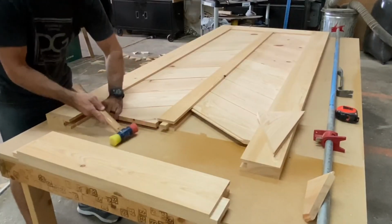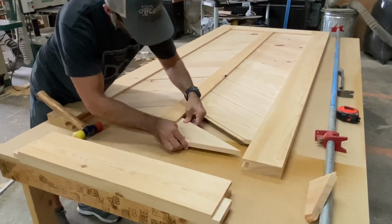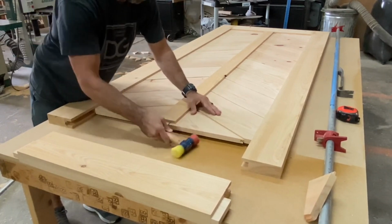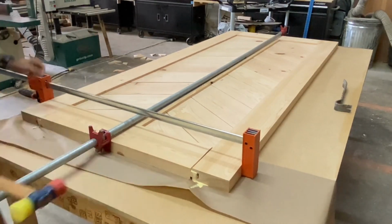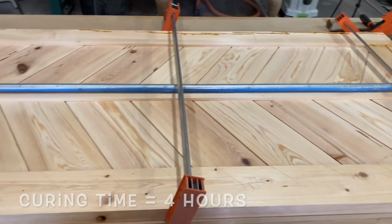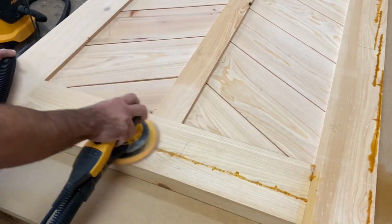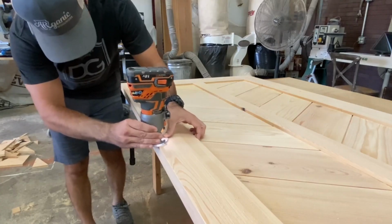Seasonal wood movement hates things holding it down like glue and nails and screws. And normally something like this, I would cut this chevron pattern out, I would glue it and nail it down to a piece of plywood and call it a day. But you end up getting warpage and you don't want that. I did get a few checks and cracks, but I quickly stabilized it with some CA glue and tinted it brown, as that will be the color I'm gonna stain it.